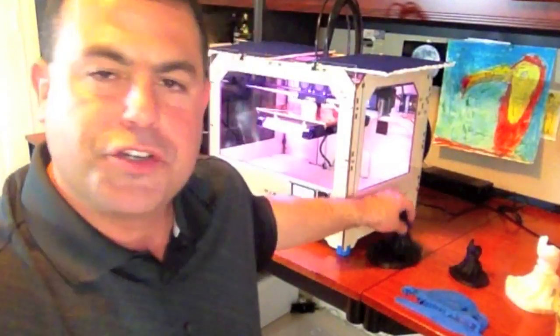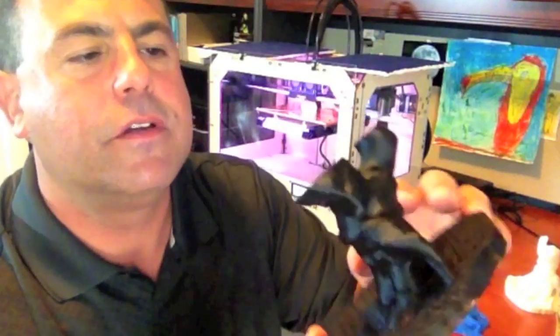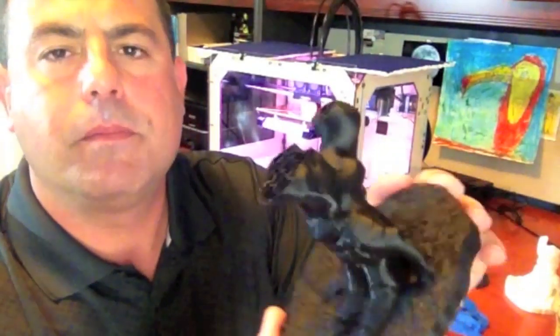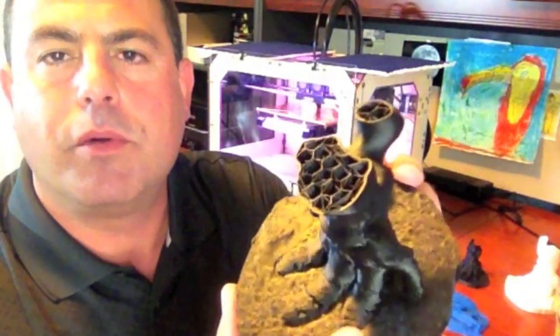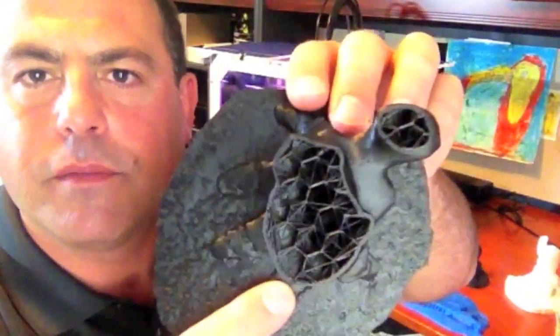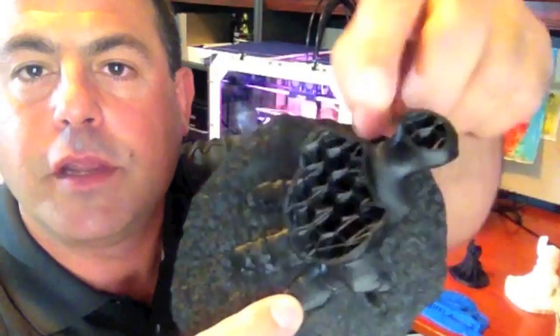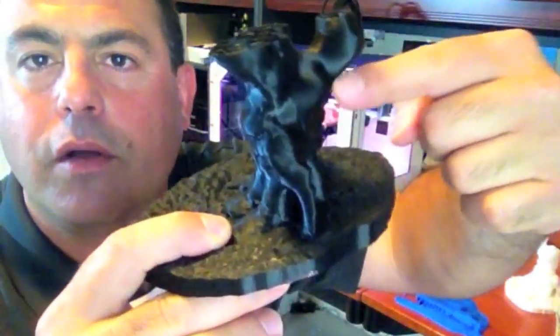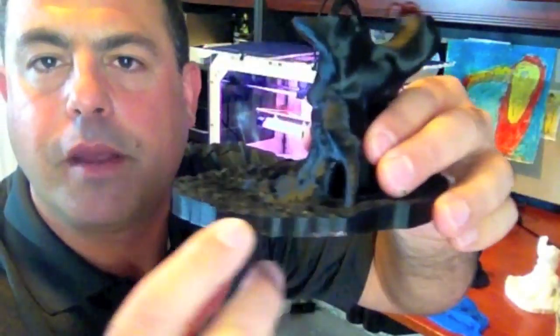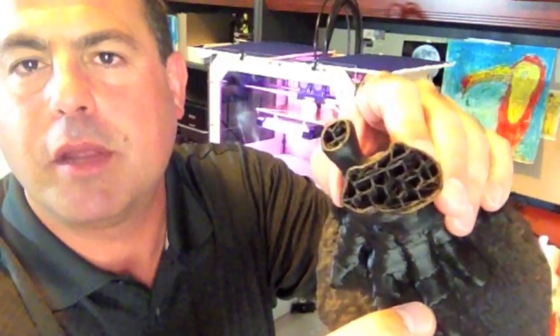There's another one I have here — I can show you what the infill looks like. This is a failed print from the 1.5 scaled-up version, printed on MakerBot 1.75mm black filament. You can see the infill there — this is 10% infill. That honeycomb structure runs all the way down, all the way through, including throughout the base. It just saves on plastic — it's still a very strong print. There's really no reason to put any more plastic inside; once it's sealed up, you can't see it anyway.